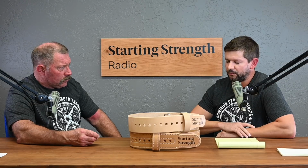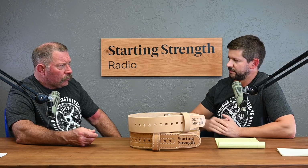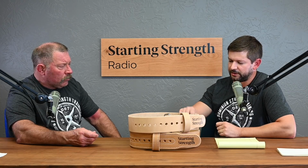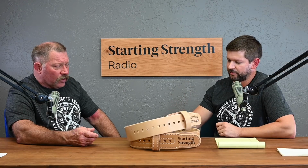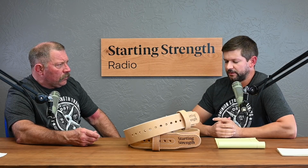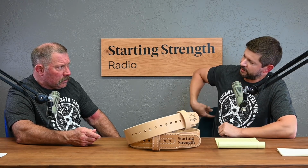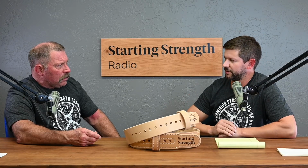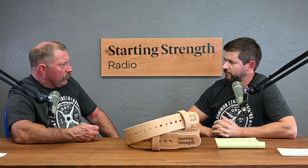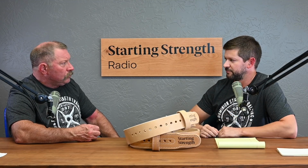Right. And what makes it sole leather then is the tanning process that happens after we split this into the 3 layers and do any other pre-processes to it. Sole bend in particular goes through a process after. Is bend another term? It's synonymous and ends up being used interchangeably because typically the cut of the hide that sole leather is made from is the bend. And where's the bend? The bend runs down the back of the animal, right along the spine, up high, down the flank, toward the posterior of the animal. That's called the bend. Okay. And that term just ends up being used interchangeably when you hear shoe sole leather, sole bend.